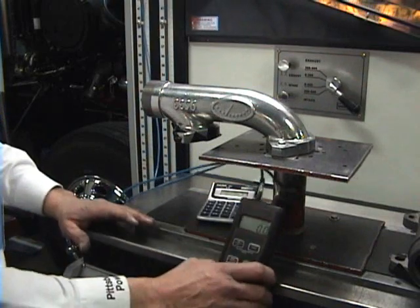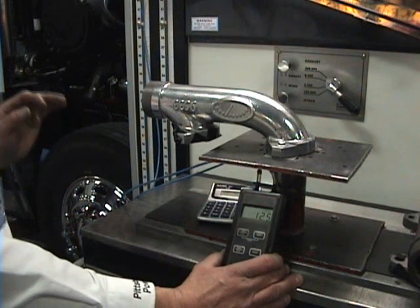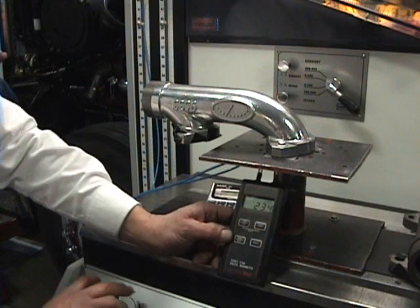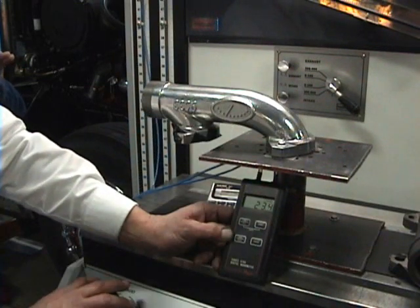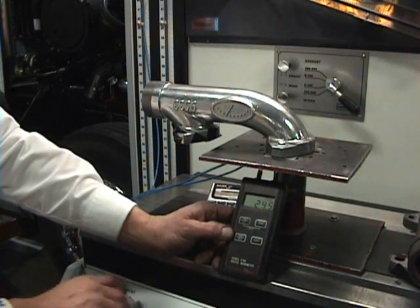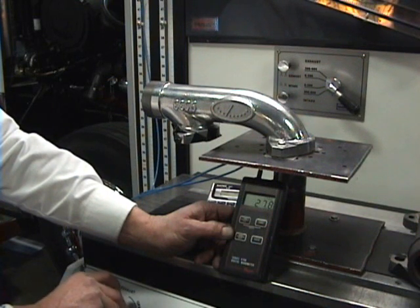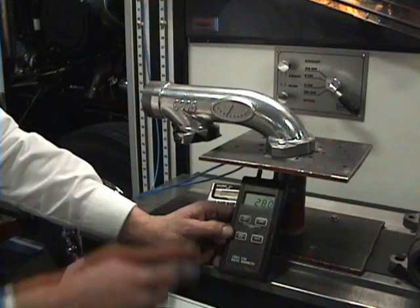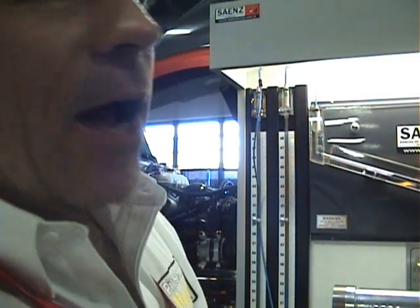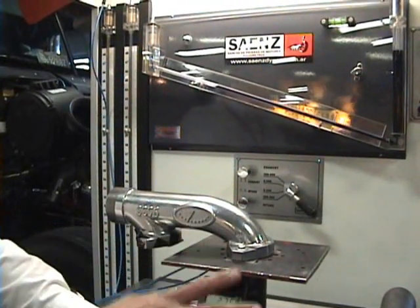We will change this and watch what it does for our back pressure here. Now we're only at 23 inches — our back pressure is lower. And now we've got to turn it up more to do a comparison. Put this up to 28. Now we look at our percentage and now we're pushing 53 and a half, 54 percent through this same manifold at the same pressure.